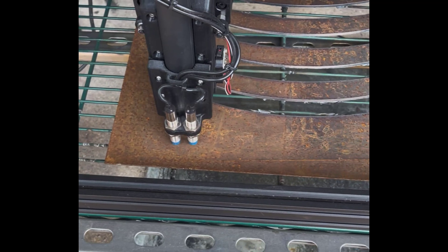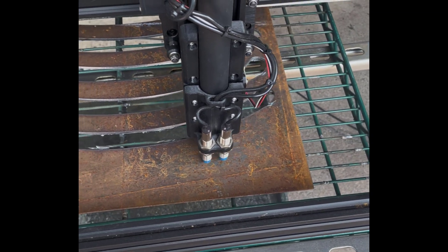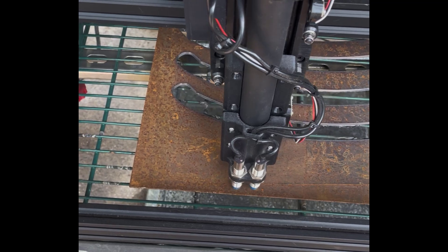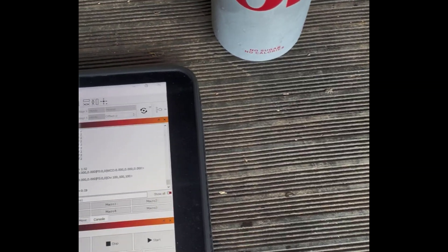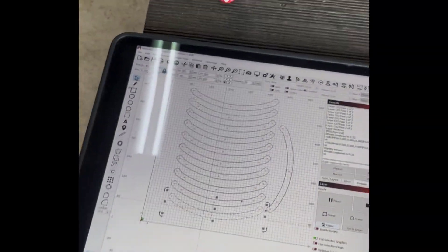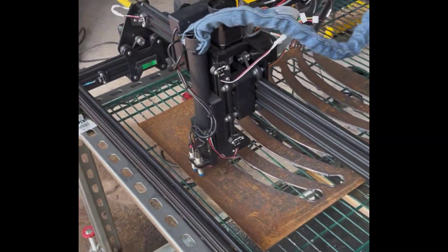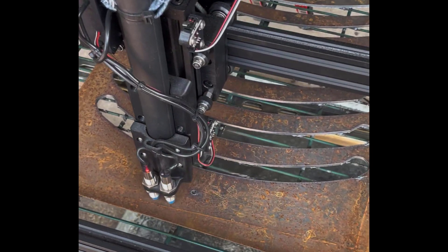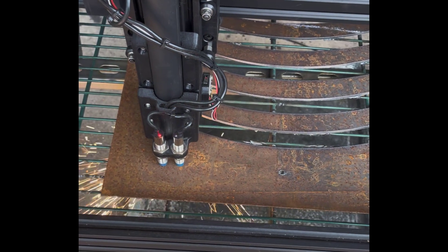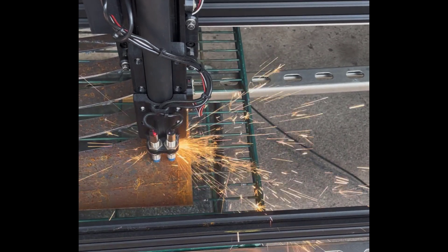You'll see those little red lights coming on and off — what those are doing is sensing the metal. I don't have the torch height control turned on at the moment to move the motor up and down, but you'll see when I'm actually cutting how that operates. I'm just going to go over here and hit a home sequence, and that's just going to home the unit so it knows exactly where it is. The next thing I'm going to do is just fire off a cut. We hit start, and you'll now see those lights going on and off depending on the height of the torch. The flickering you see is when it's adjusting its height.